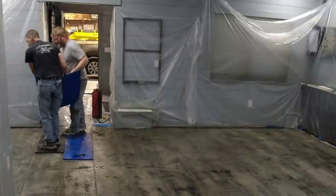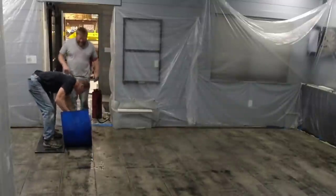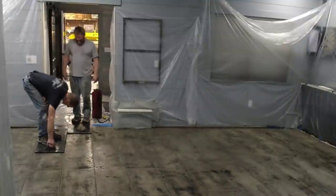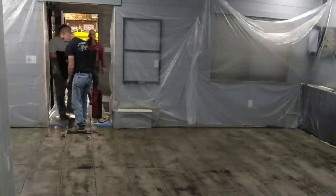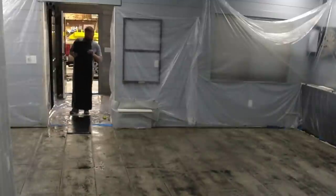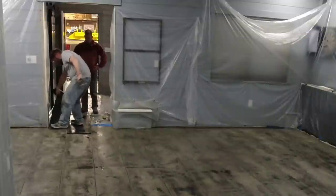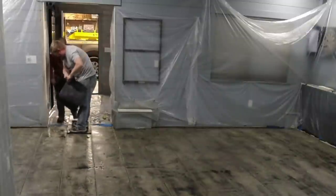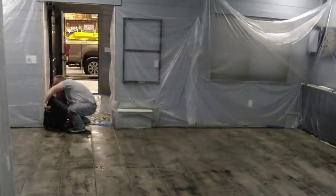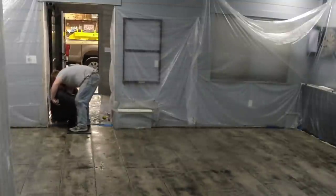We're going to finish that little piece out, then I'll show you what it looks like to get this all cleaned up and sealed. The next day we came in and washed it with soap and water - just some Dawn dish detergent - scrubbed it in a little bit, sucked it all up with a wet-dry vac, rinsed it a couple of times with clean water to get up all the residue, sucked that water up, and let it dry for 24 hours. Then we came back and sprayed three coats of D1 decorative concrete sealer that we use on all our stamped concrete. I'll have links to all the products in the description.